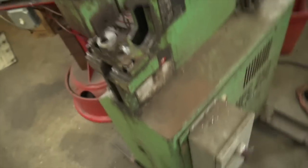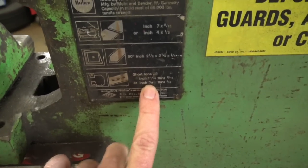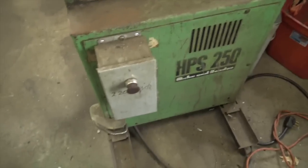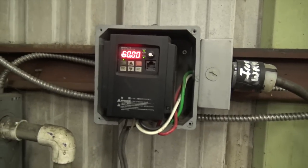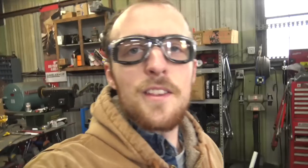We can see everything fits in here really well. One last check to make sure we're not going to be over-exerting ourselves — 7/8ths holes through 3/8ths plate, not bad for a tiny little 20-ton ironworker. For those always asking, this is a three-phase machine; I run it off a VFD. I've had it for years, it works great even though I still don't know what it's actually called. Let's start punching some holes.